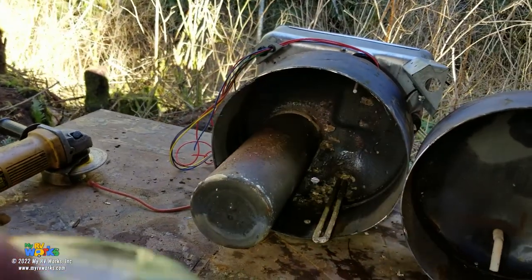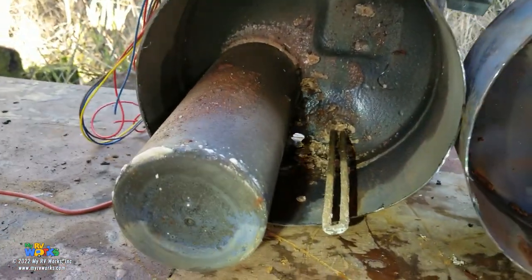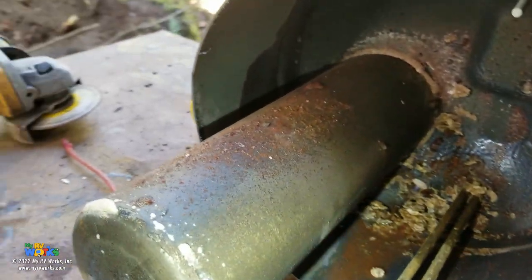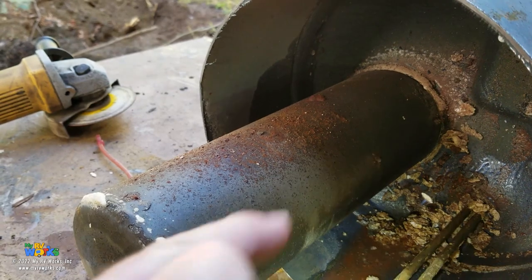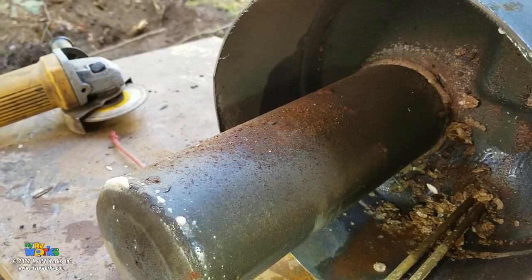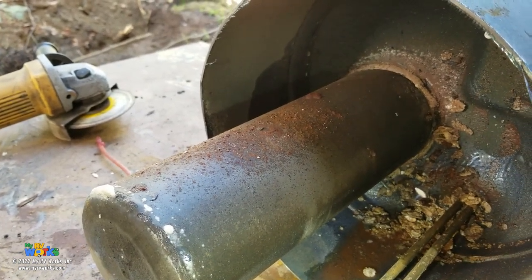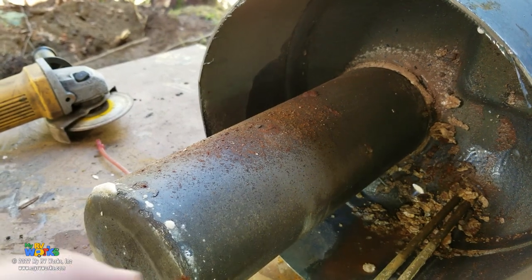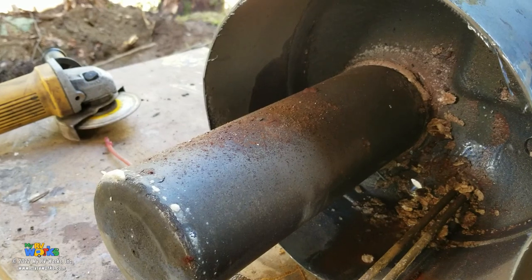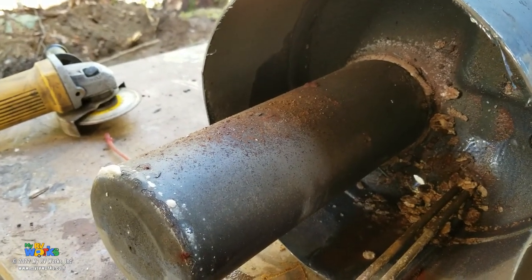And so here we have, get my light shining in there, right? The inside of the Suburban water heater. And so since I got my grinder going, I'm going to go ahead and cut this long tube right here, cut it in half. And what we're going to see is halfway down, it's basically a flat stock welded in the middle, but then in the very back of this here, it's open so it can come in the bottom and flow out the top. So let's slice that in half, and then we'll cut open the 12-gallon,